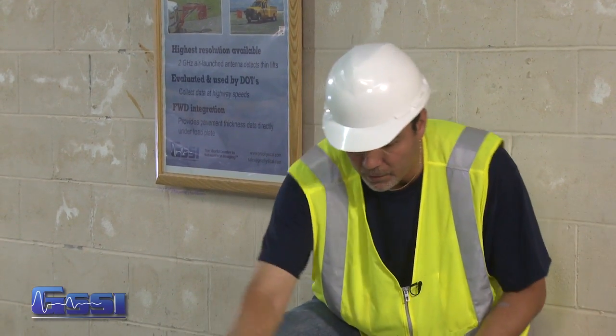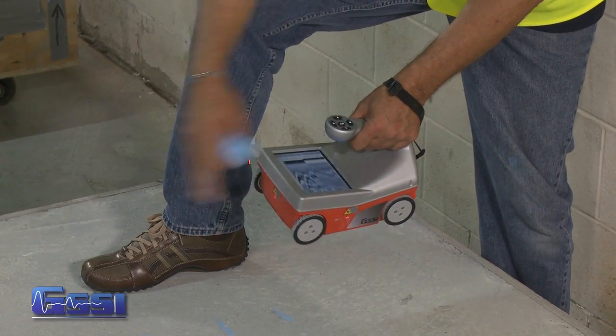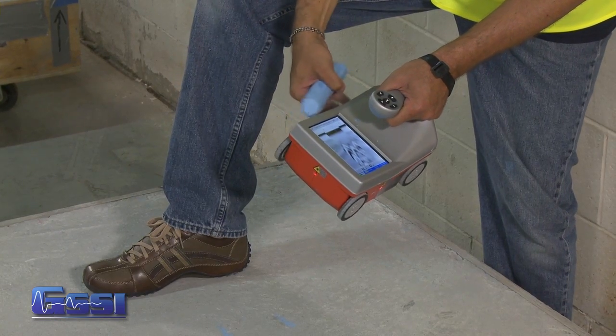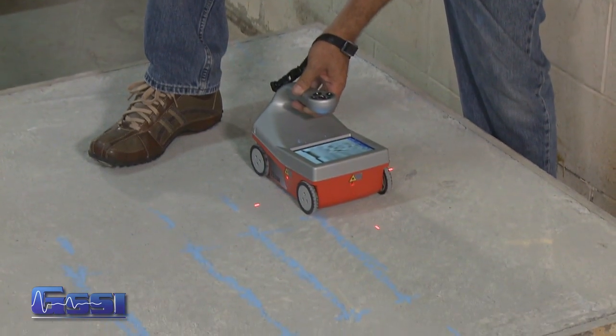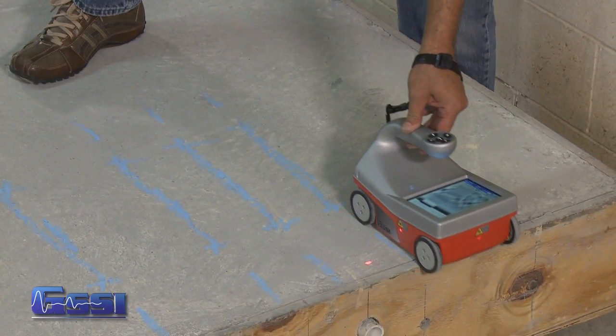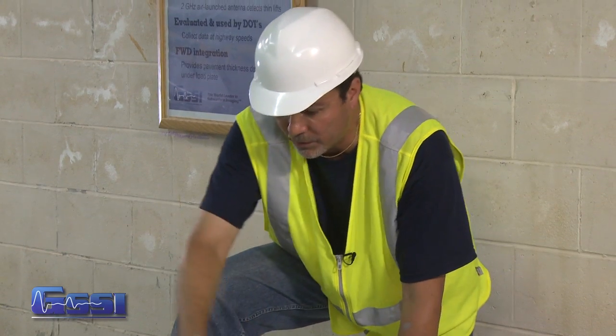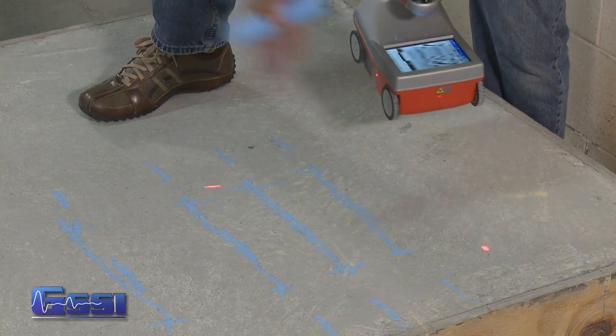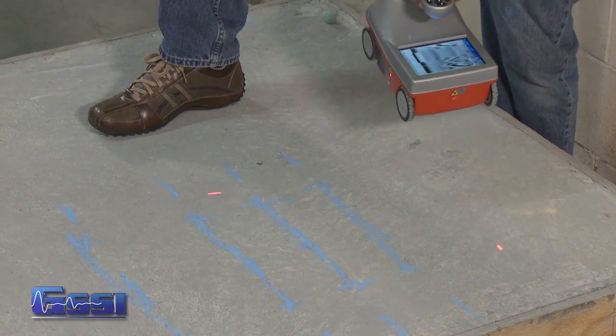The reason being is that I found all the targets running this way. Now I have to go the other way — I roll my wheel forward to get blank data on my screen and go in this direction, doing the exact same process of marking out where my hyperbolas are, going 3, 4, 5, 6 inches over, marking and connecting the X's. So now I can find the targets running both directions.